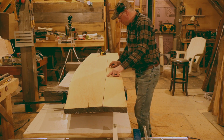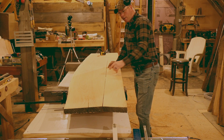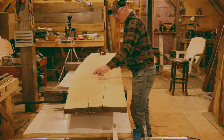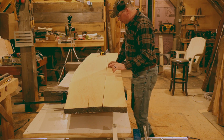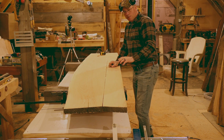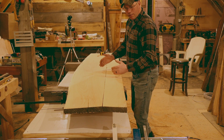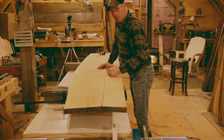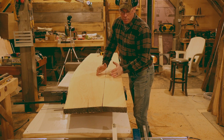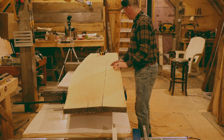The edge here, where some of the growth rings had a little grain shake in these slabs, this tree, if you can't tell by the bow in it, was under quite a bit of stress as it grew. The other thing I want to point out, if you're doing it this way, get these slabs lined up the way you want to orient them for your end project, because if you slide them one way or the other, and you're only doing this with a saw, if you don't put them together exactly how you cut them, you're not going to have a nice tight line down the middle.